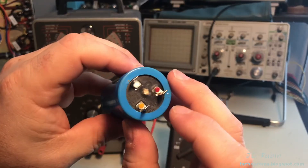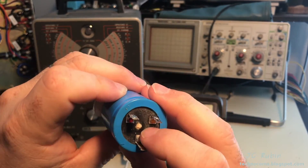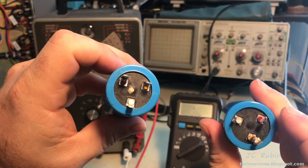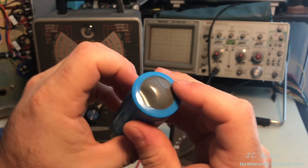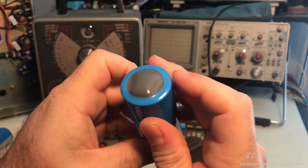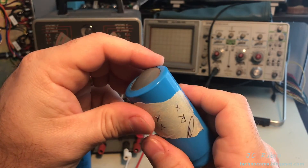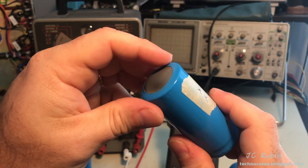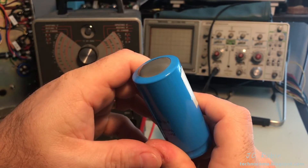I think that's why these all failed. It's not to say age wasn't a factor too - some of what we see on the bottom may have been developing over time and probably wasn't part of a singular event. But when I look at this damage here, I believe this was part of a singular event that happened when this amp was brute-force turned back on, multiple fuses were put in to try and keep it going, and it got really hot and boiled over.